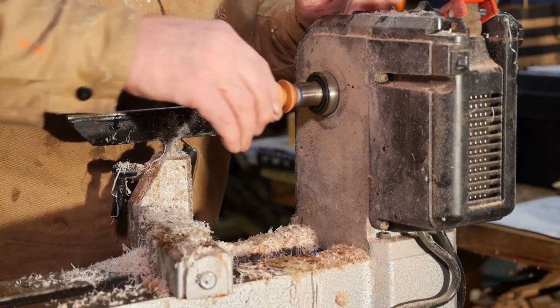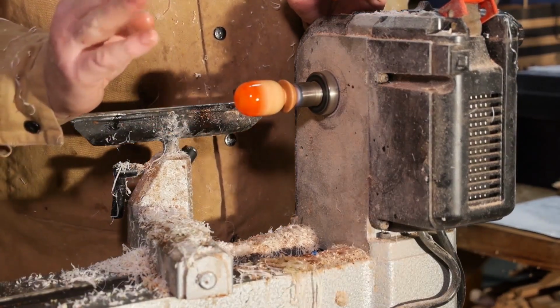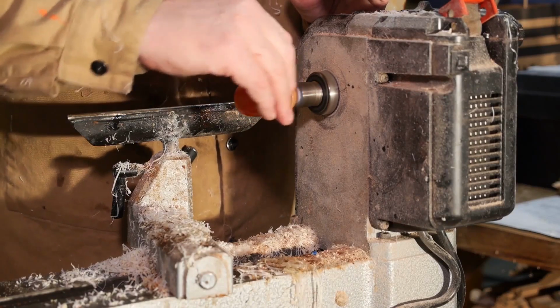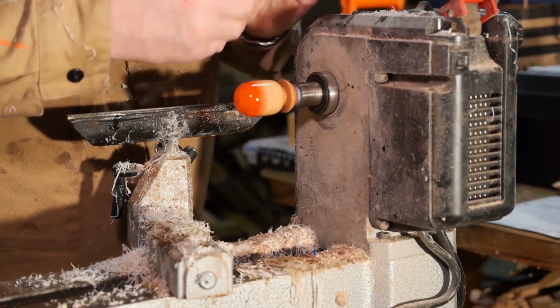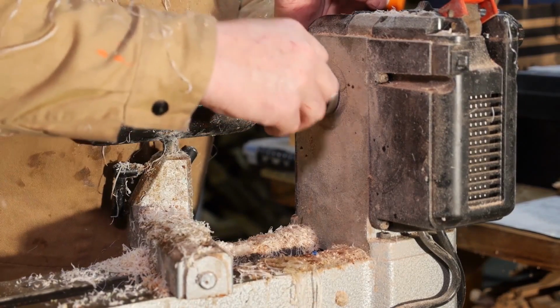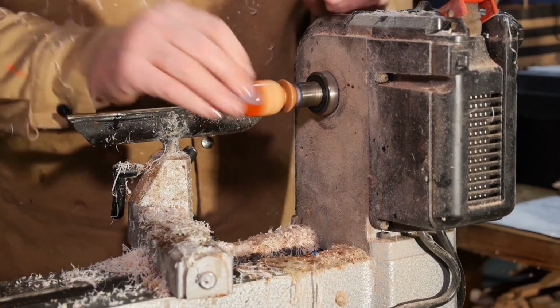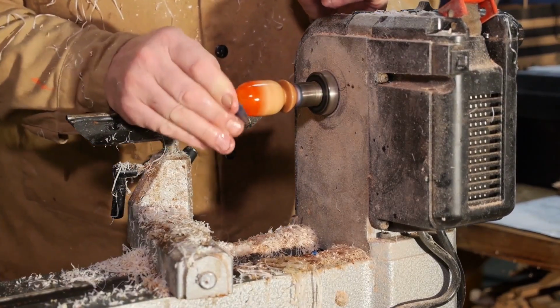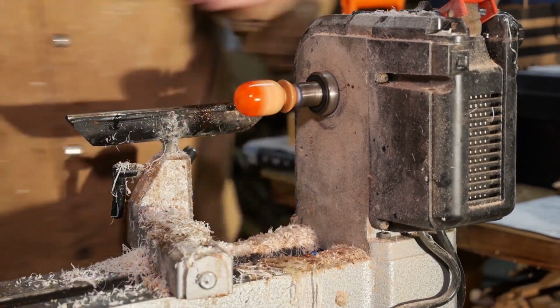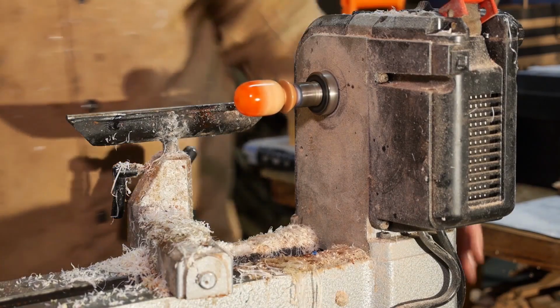Now, the wood is really pretty much done by the time we get up to this, looks like 2,500 or 3,000. But the Alumilite prospers from the additional sanding. It looks pretty good at 1,000. But the additional clarity you get by sanding through the rest of the grits is well worth the few minutes it's going to take to do it.